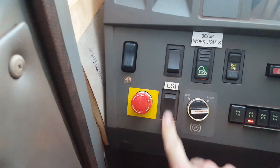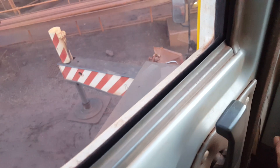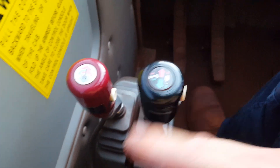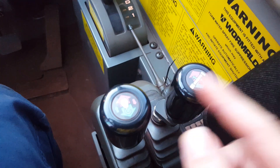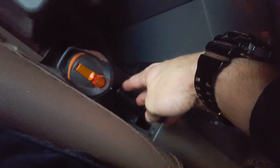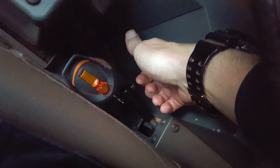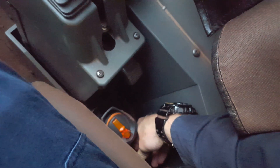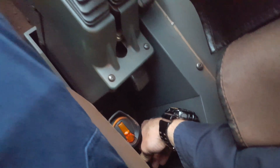Wind is good, turn that off. That's your windows. Now your levers: small hook or tele, slew, big hook, luff, or jib up and jib down. Here is your slew brake — grab that and pull it up to release it, or push it down to lock it. I always look out the window and line it up with the side of my chassis, try to get straight, and that should go straight down. If it's not going in, just sit down, slew left or slew right, and then it'll slide in.